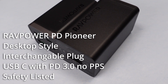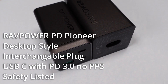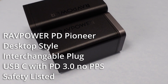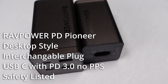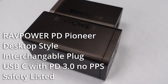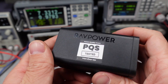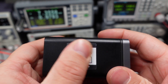In conclusion, these power adapters are not going to be taking home any awards. The RavPower brand is a minimum level power adapter that has safety listings and meets the minimum requirements for power efficiency and idle requirements, but they don't go above and beyond. The 120 watt power adapter has power factor correction, but it's only used in modes above 55 watts, so you can get stuck with this one. The AC power and DC power stay within reasonable limits though. Time to apply the stickers — these are tested and on the database, but not winning any awards, while also not being terribly offensive performance-wise.